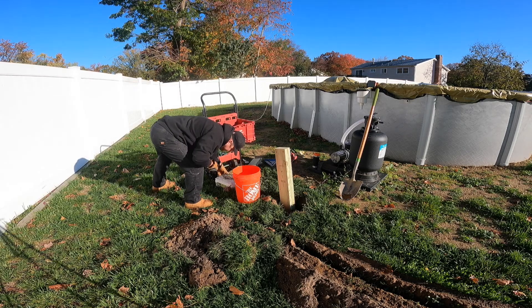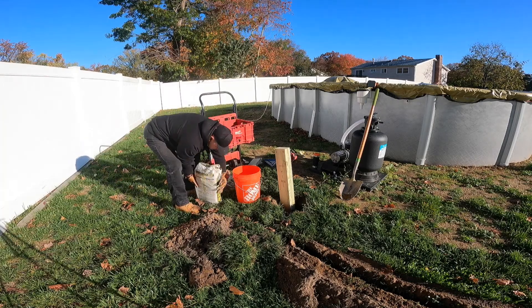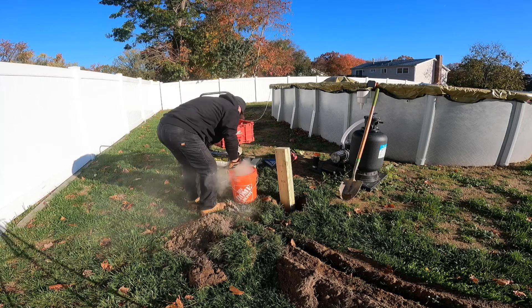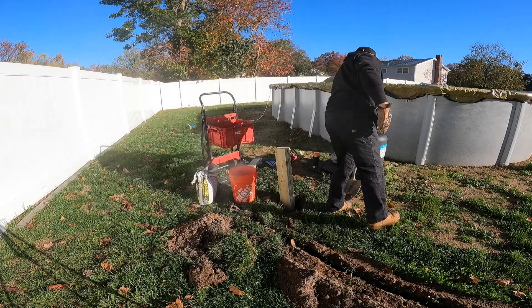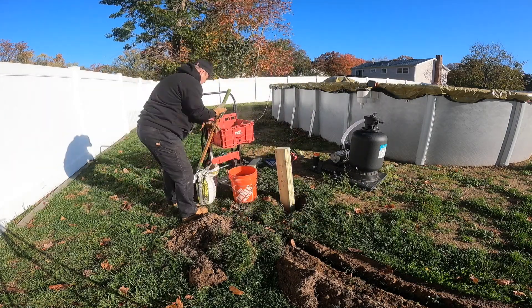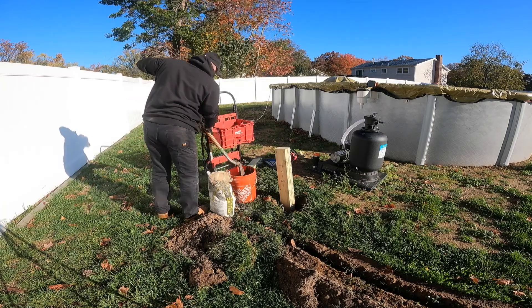When doing these storable pools, there's a lot of planning involved. For instance, this wooden stud that I have in the ground — you've got to be down at least two feet. The reason is that when the frost hits the earth, it'll heave out, and two years from now it'll be swayed from side to side and look bad. So I use concrete here to sturdy it up, and that usually prevents any problems in the future.